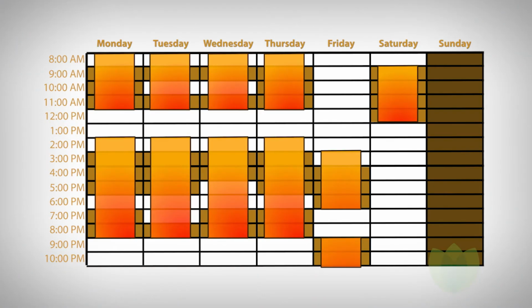After the copy process, the thermostat will display Friday starting with program number 1 with the hour flashing. As you can see, Friday has a totally different schedule than the rest of the week. Use the same process we went through for Monday to set Friday's times.